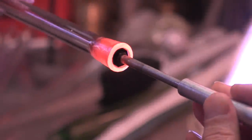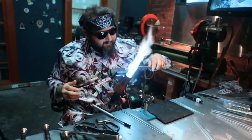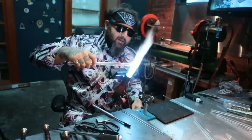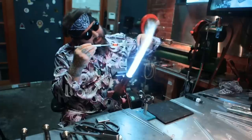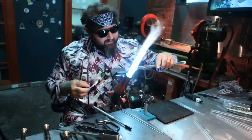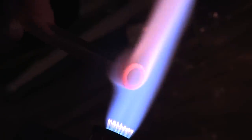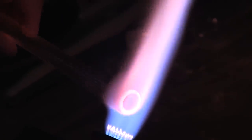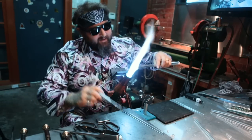So we'll do that here — just heat up the whole thing a little bit more, go ahead and push that in. You can see it's right down to the edge of the tool. It's a little bit bigger than the tool right now, so I'm going to go in and condense the wall back down a little bit so it's right on the edge of just being able to fit. Heat it up, push that in — you can feel it right on the edge there. And if you want, you can even thicken up the lip a little bit — just heat that and push it back with a paddle or some jacks, get it nice and thick. It'll make it just a bit stronger too.